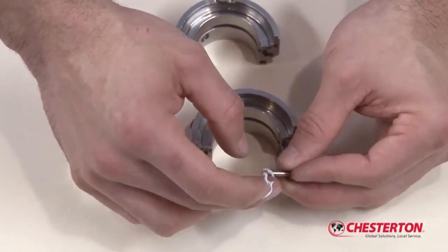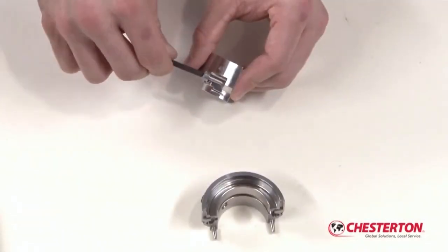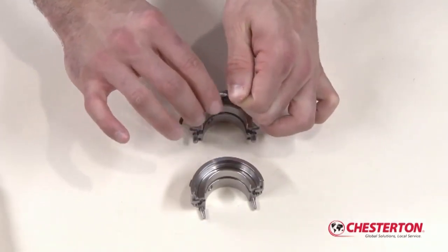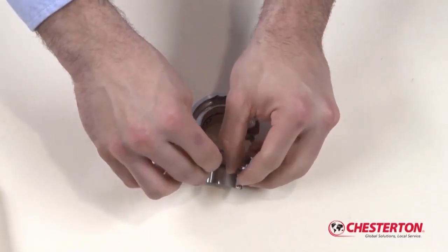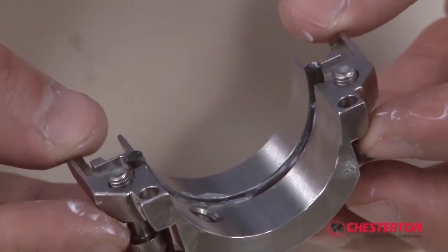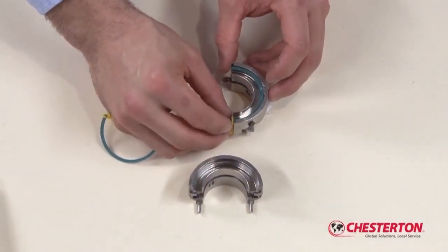Lubricate the threads of the socket head cap screws with an anti-seize compound or suitable lubricant and install in the rotary holder assembly. Apply a thin film of silicone grease, provided in the kit, on the shaft O-ring halves and install. O-rings must protrude evenly from both holder half ends. Install the rotary holder shipping spacers in the holder halves.